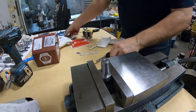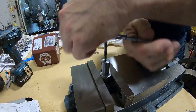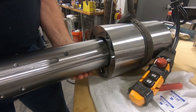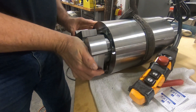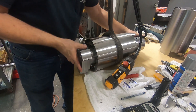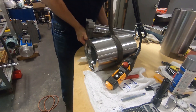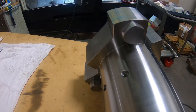Here I'm just tapping these holes to depth on these pins. I just started the tap in the machine to make sure it wouldn't break. Here I'm inserting the mandrel — that's the part I had to re-bore to get it to go in. But that's all very close fitting; it slid in real nice. There's only like two thousandths clearance on that ID and those pins only have about a thousandth or a thousandth and a half clearance on the holes. So everything seemed to line up real nice. That's this part of the fixture complete.